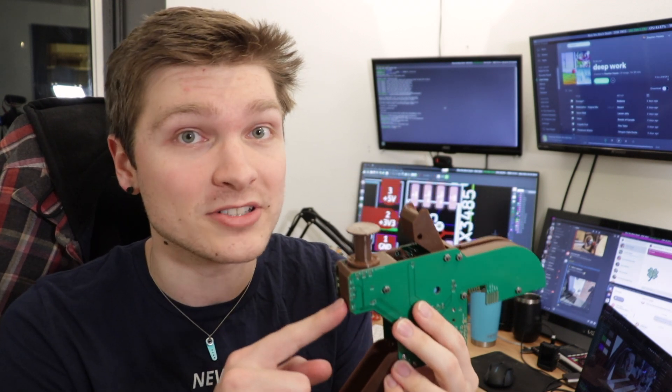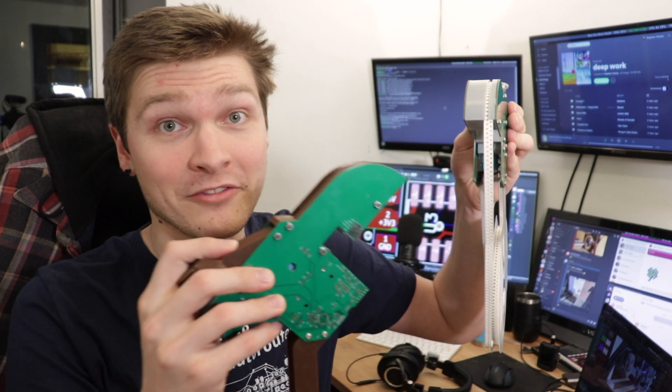This is the exact same as the first feeder that I made, except that it takes 12 millimeter tape instead of eight. So now that I have both of them, I'm going to try and get them to listen to the RS-485 line from the motherboard and use that to send commands from OpenPNP to tell them to move forward tape.